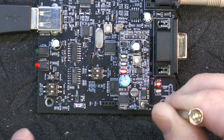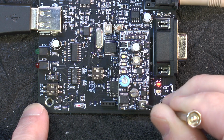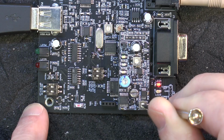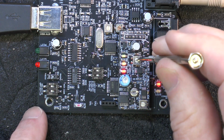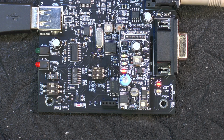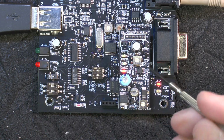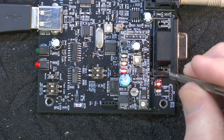Now this guy pauses a lot in between his talk, so you can see that the LED is shutting off on his pauses. So depending on how long you want that to hold, you just bring this timing up. And maybe we could give it a little more audio input. Okay, and this LED here means Echolink is keyed, which really follows this red LED. So that's about right. I don't think most people pause like this guy does. It's talking at the moment, but that can all be adjusted.